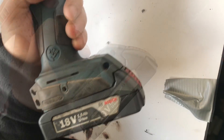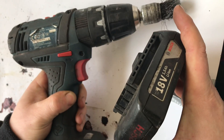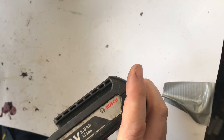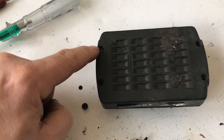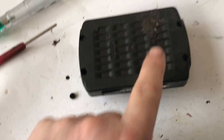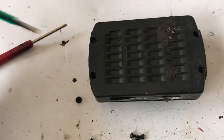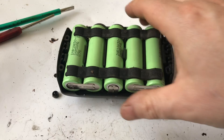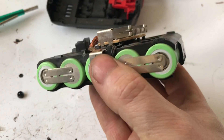So in this video we're going to fix the battery as cheap as we can. The first job is to separate the battery from the drill — we're not going to need the drill for a while. There's a little safety cover in the holes here, and an ordinary pick will just get it out. Then there are three screws, and a fourth screw just here — a normal screwdriver just undoes them. Now we can separate it and these are our cells.